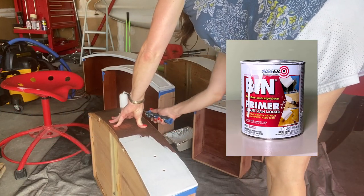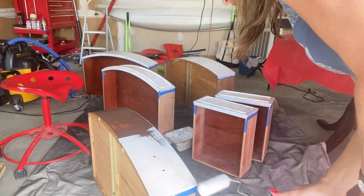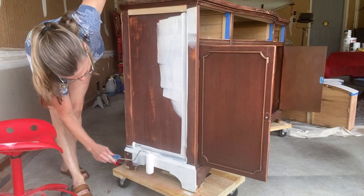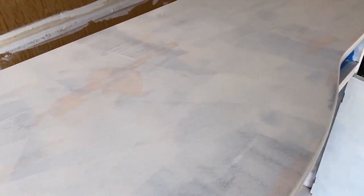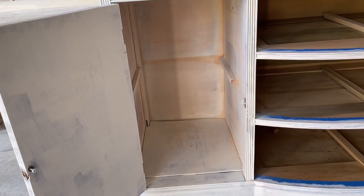I started the process of putting the first coat of primer on, starting with the drawers and then the base. Look at all the bleeding from that first coat — it was a bleeder, especially those inner cabinets. It took, in some places, four coats of Zinsser shellac-based primer, and this thing is finally ready. I've sanded it smooth and it's ready to be painted.